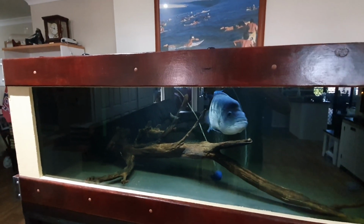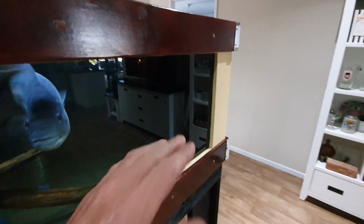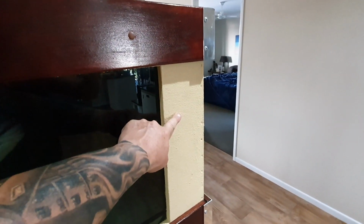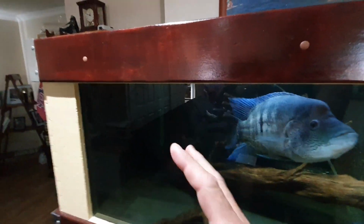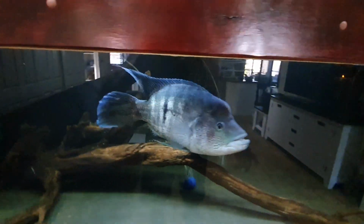I waited, I think, 48 hours. I got all the fabric in. It's going to bunch up the fabric too. In the corners, it's a bit hard to get straight. Don't stress it. You'll be so surprised how much this pond sealer hides. I've got bunched up fabric that wasn't perfect, and you'd never see it in the black pond seal. So that's no drama. Just do as best you can and smush it in there well. Wait 48 hours. Do it again. Lay your second lot of fabric right through and smush it all in and wait your 48 hours.